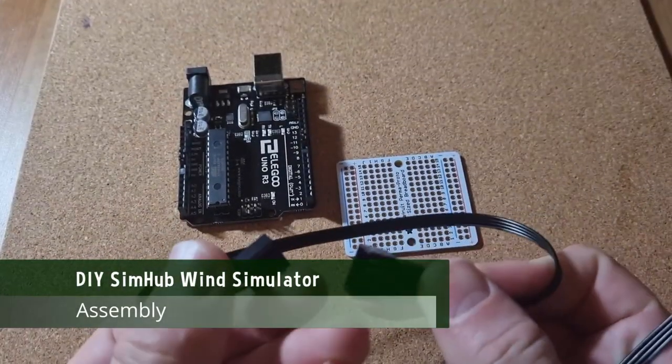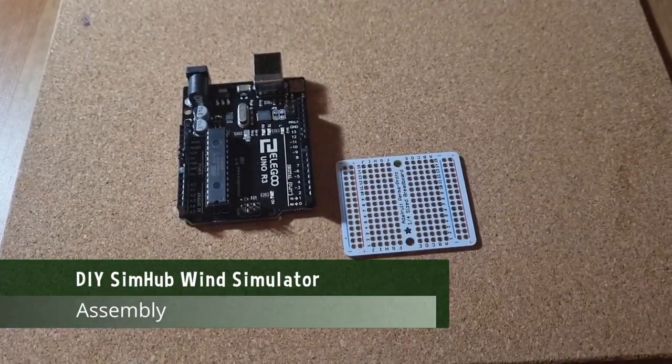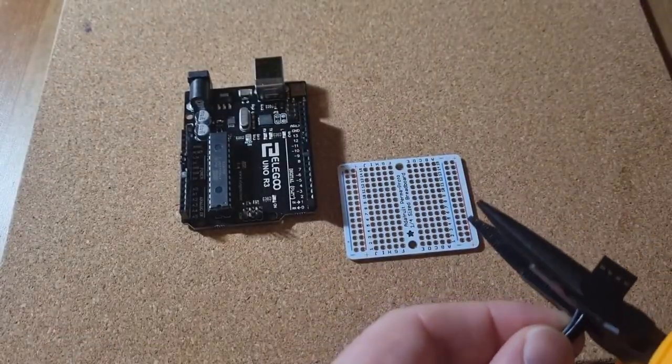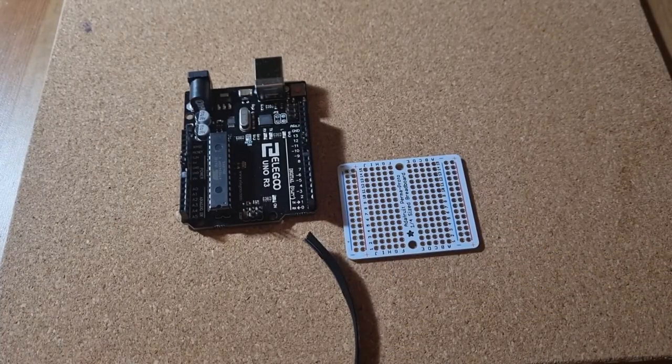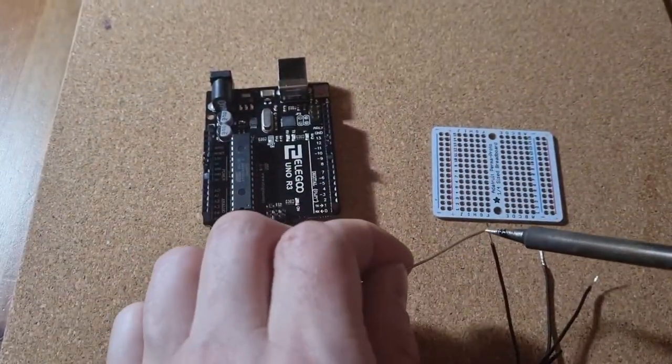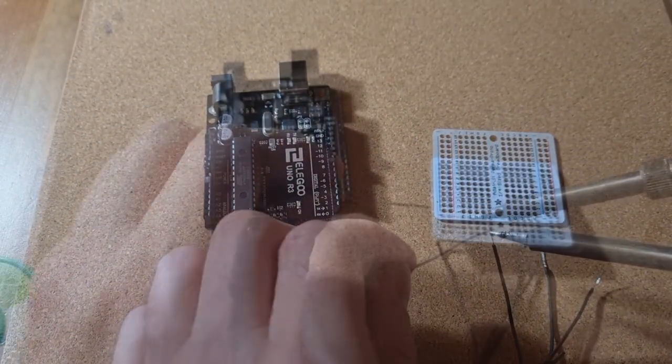Without an air straightener you're probably going to get a diminishing return on your airflow, but you will still be able to build and follow this project. I've linked in the description some alternatives that you can use without a 3D printer at all. To help my unsteady hands we're going to be using a perma proto board - in this heat I'm very unsteady so I want something that makes it a little simpler to build up and for you guys to follow. For assembly, let's start by cutting off the male ends of the fan extensions. We'll be soldering these to our breadboard so we don't have to hard wire our fans to the control box. Next up we have to split and separate the wires, tin the ends, and then solder onto our breadboard.